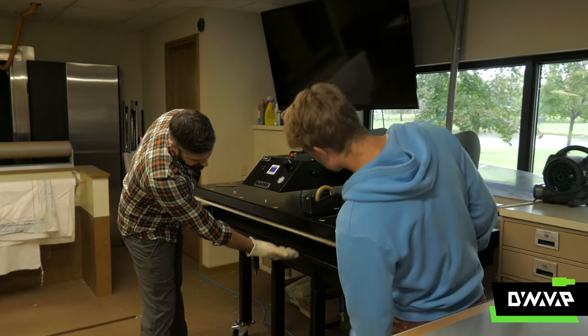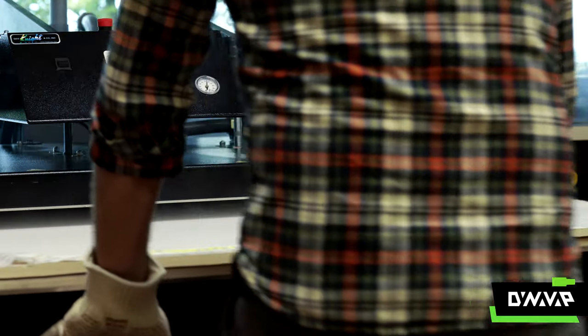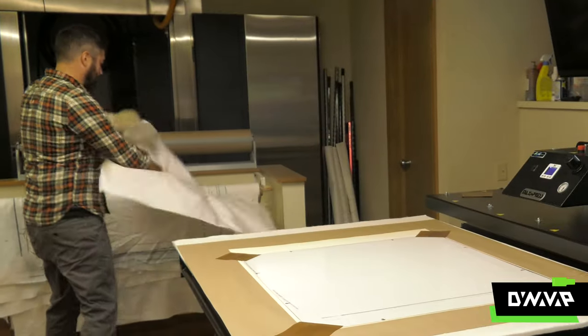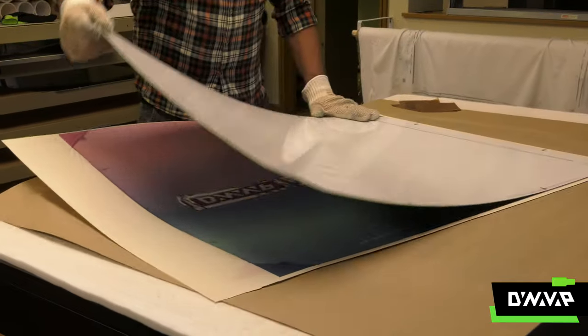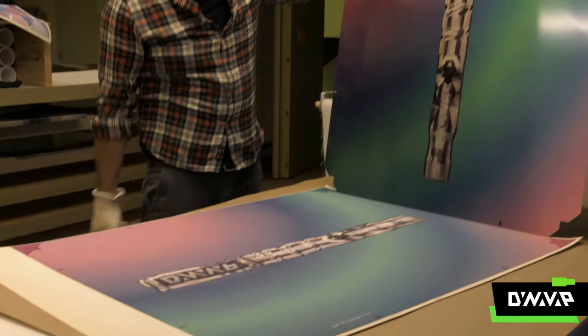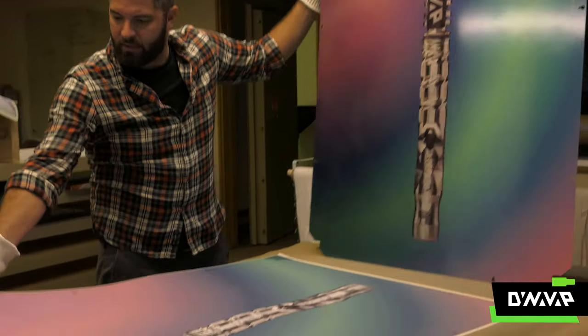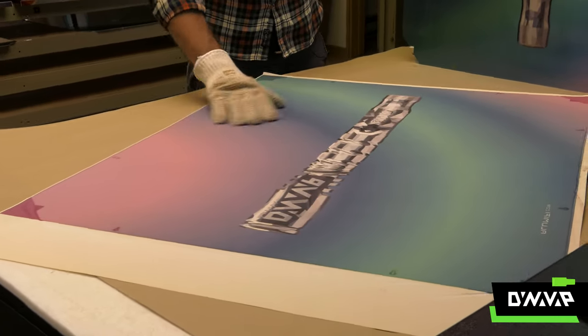The drawer drops, which releases the pressure. We get our vapor barrier off, remove the Teflon pieces, and pull up the print. Wow — there's your image. Very cool. You can see that you've lost some of the tone on the paper — this is the leftover ink that's still in solid state on the paper, which has now been transferred to the aluminum.